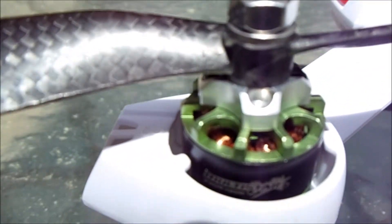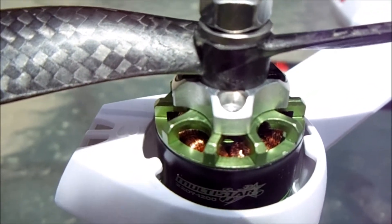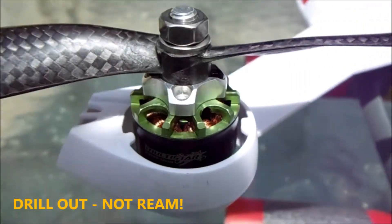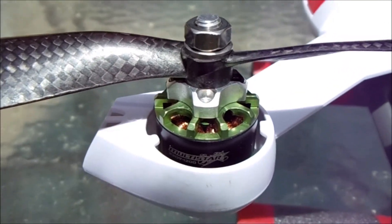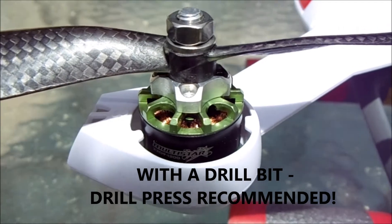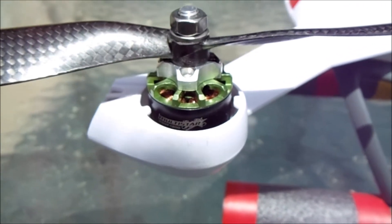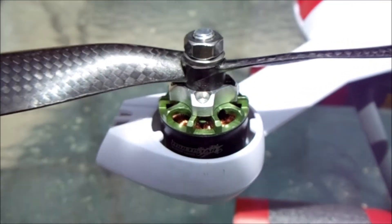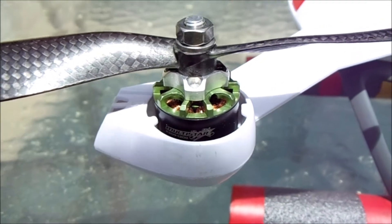I'm not going to show you a video of how I did it, but I'll explain — it's really not difficult. What you'll have to do is ream out the shaft hole in the CNC prop adapter with a drill. I did this very carefully, and I do have a drill press. I don't think using a hand drill to bore out the bottom of the CNC prop adapter would be advisable. But if you have a drill press, you just look at the shaft, get the appropriate drill bit, and take your time. If you work with aluminum, you know that it will heat up as you drill. You want to make sure you keep getting the shavings out of the hole that you're making.